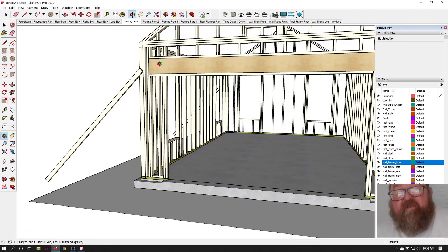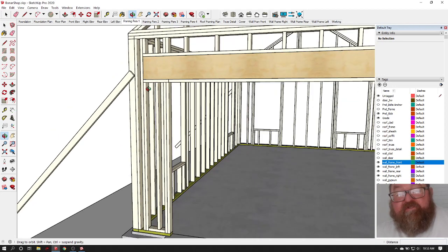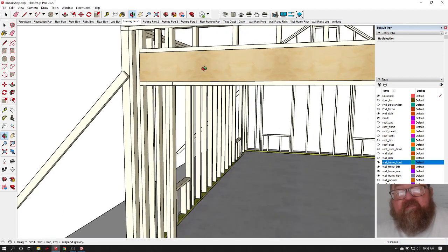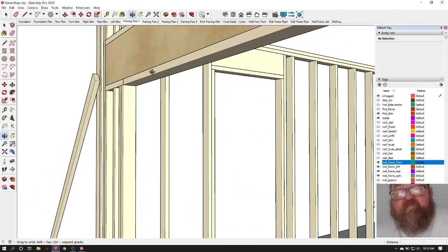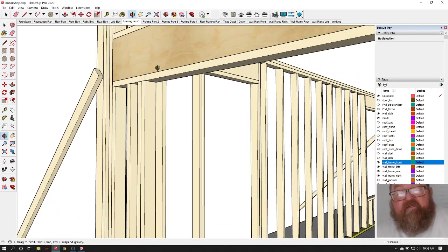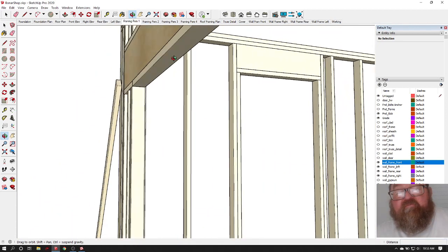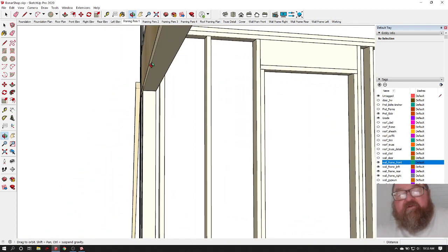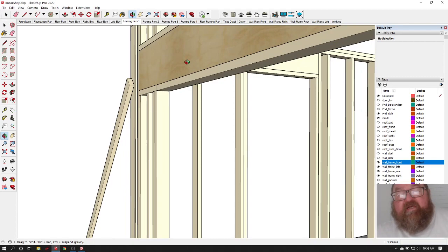It's really top heavy. So what I like to do is just build most of the wall and stand it up, you know, top plates and everything. Leave out these little blocks, and then set the LVLs up there one at a time. Right? You take an LVL and then you nail this 2x6 or 2x4. Sorry, I'm so used to building 2x6 walls now. Take your 2x4 and nail it to one side.